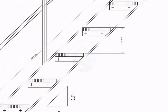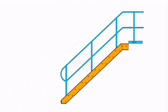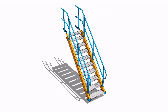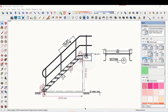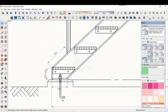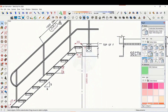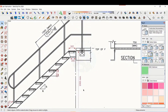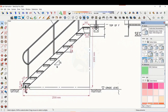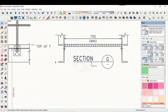Let us have a look at the drawing in its 3D model. The slope ratio of the staircase is 5 to 6. This is the standard drawing of a staircase. Most commonly, ISMC 200 is used to make the major component of staircases. The distance between the two steps is 200 millimeters. The height is 1900 millimeters, the length is 2500 millimeters, and the width of the staircase is 750 millimeters.